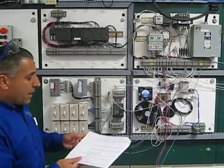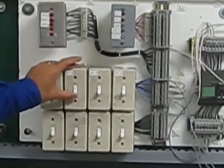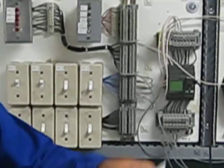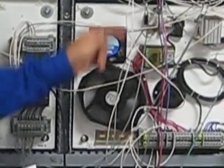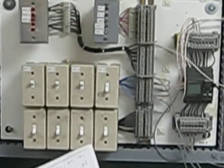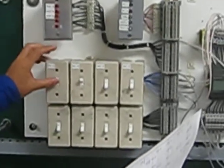I'm starting the control circuit now — the system is ready to go; the pumps are not running but the system is ready. Based on our design and programming, we need the on/off switch to be on, and we also need the pressure switch to be on. Input 3, which is the third switch, will give us manual pump 1 based on our design. Here we go — pump 1 is started manually. You can see the contactor latched to energize pump number one. I can also control it with the pressure switch — simulate off, on, off, on.